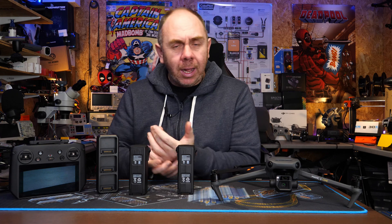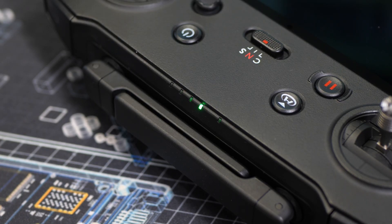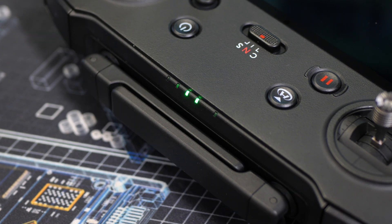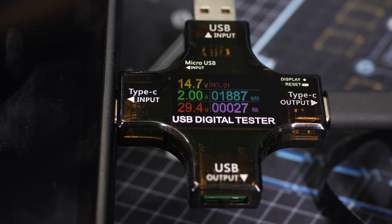Finally, a quick note about charging the smart controller or remote. On the DJI adapter there are two outputs: the hardwired Power Delivery PPS output and the standard 5V 2A output. I recommend charging the remote via the normal 5V output as much as possible. Whilst you can fast charge it via Power Delivery, the slower output will give you the best possible lifespan from the internal battery. The slower you can charge your batteries, the more lifespan you will get from them.